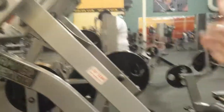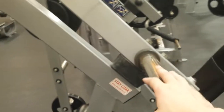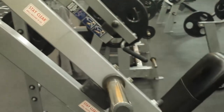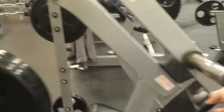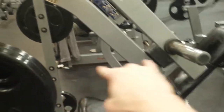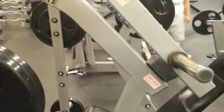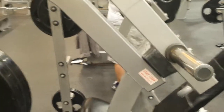Let's look at the distance. Assuming the weight of the arm is negligible — which it will be if you have a significant amount of weight loaded — gravity's pull on that weight comes down vertically and that won't ever change. If we measure the distance between the weight and the axis, drawing a plumb line and measuring that perpendicular distance, my estimate is between 15 and 18 inches. 18 might be pushing it, but I would say over 15.